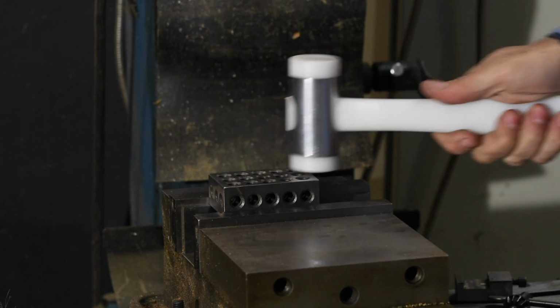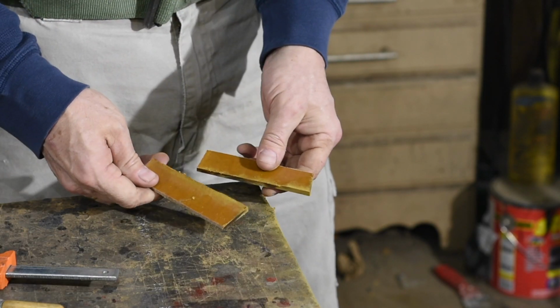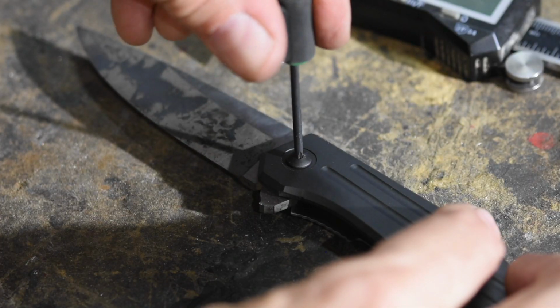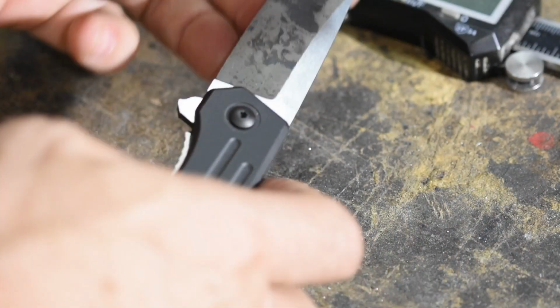So a second point about flatness is that if you're working with any material that's not flat or that's irregular in any way, it's a pain in the neck to fixture and to handle it generally because it just doesn't lay flat in your vise or whatever surfaces that you might want to be working on. So flatness will help you out in a lot of other little tasks prior to actually putting the whole knife together. Additionally, a flat surface can be used as a reference surface for establishing other important features of the knife, like holes or knife scales, folding knife pivots, and so on. Flatness is extremely important in folding knives because if something's not flat, the pivots are not going to work right, just all kinds of stuff will go wrong.